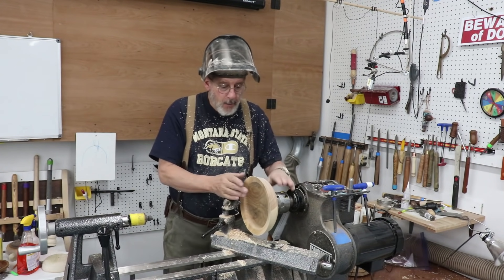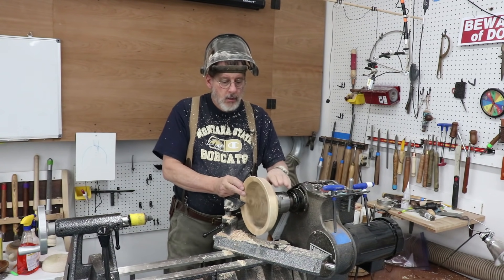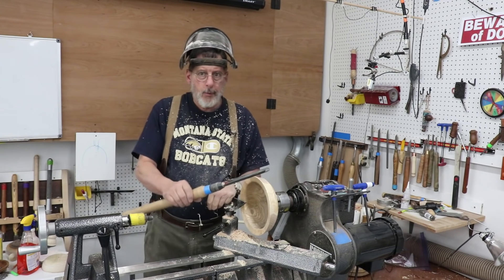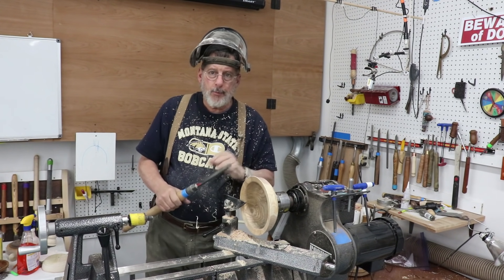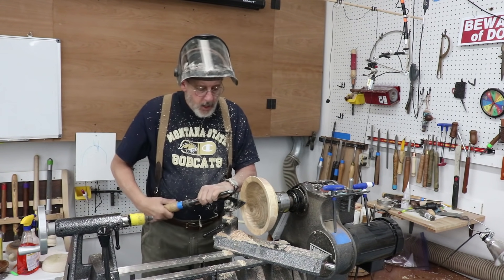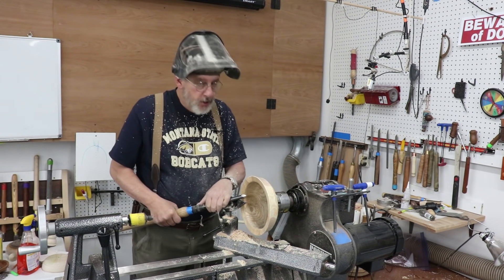Dealing with the inside. The first thing I'm going to do is true up the different surfaces I'm working on — first is this rim right here, and the rim can get you into trouble. I would recommend finding a good bowl gouge. I'm going to use a pretty big 5/8 inch gouge. My flute is almost completely closed — you have to be really careful, you can get a bad catch on the rim. So we're going to true the rim up here and just scrape that to begin with. I'm turning the speed down to about 700 RPM.